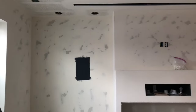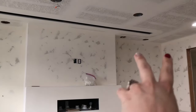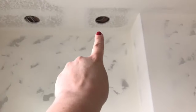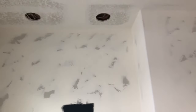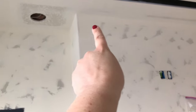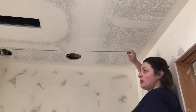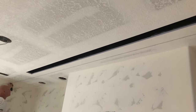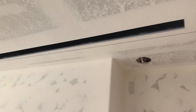Our plan is to have two sets of bookcases on each side of the fireplace, so we're not going to worry about running shiplap all the way to the back wall since the bookcases will cover it. We're starting at the front of the fireplace wall and beginning by snapping a chalk line across the ceiling to make sure we have a nice flush, square line to start with. We lined the chalk line up with the theater screen box in the ceiling.